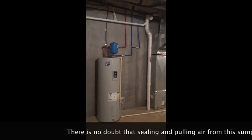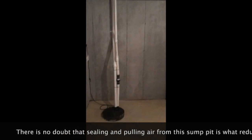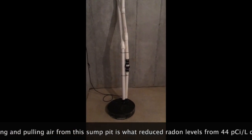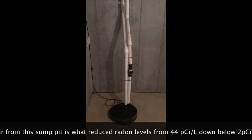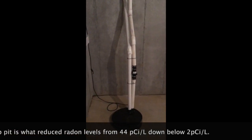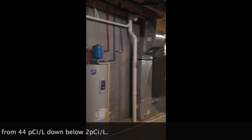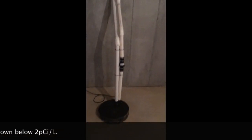Activating the system — nothing really eventful in the attic, just a normal fan install. But down here, when you encounter a sump pit, you've got three options: ignore it, simply cover it as best you can, or pull from it. And with wind coming back at me and the system so close, this is a no-brainer — go ahead and pull from it.